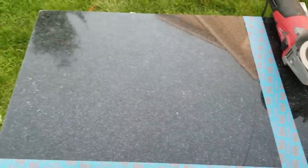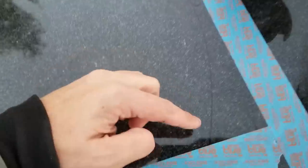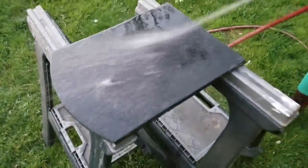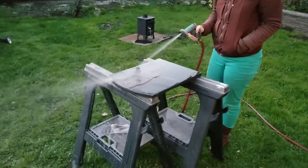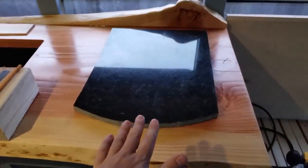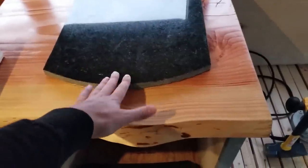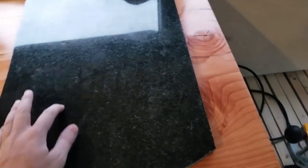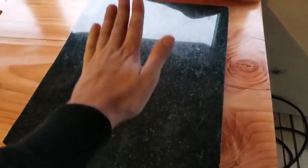This is the shape that the hearth is going to be in. This is my slab. I'm going to cut a straight line through here and there and create a rectangle, but then there's this curve that's going to be in front. So this is my hearth — it's a piece of solid granite, three quarters of an inch thick. The stove is going to sit on top of this. I'm going to inlay this into my countertop. In order to do that, I need to router out a three-quarter-inch-thick hole in the countertop that's this shape, so I can drop it in.